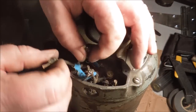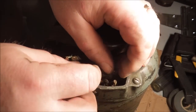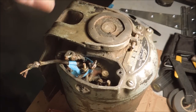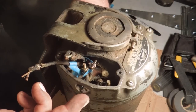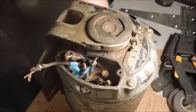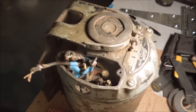Now, because it's a motor, it is better to have stranded wire. You don't want to have solid wire on a motor. It will tend to vibrate and crack. So, I'm going to make extension wires and cable them up and bring them out through this opening, through a connector. I need to have six wires in the cable, so we're going to have to be a little fancy with the way we do that. Have to do some thinking on this one.